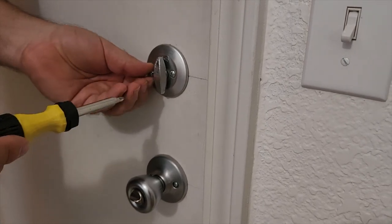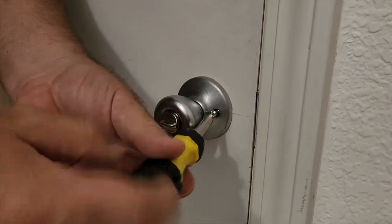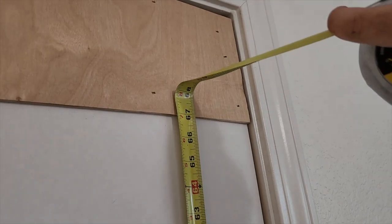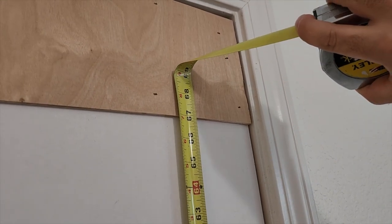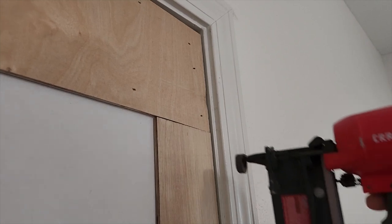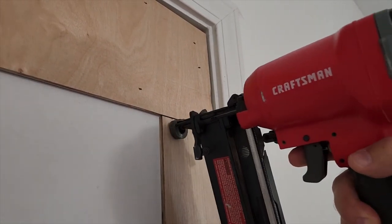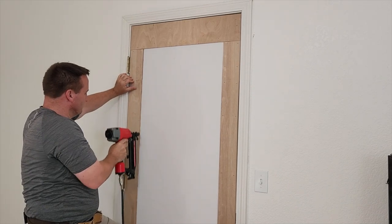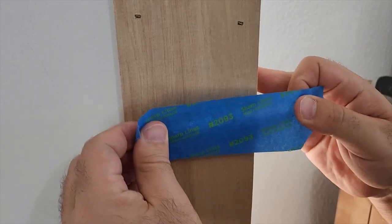Next, we've got to take the doorknobs off because we've got to put our trim around the sides. Six inches along the top was the width, but on the sides we're going to go a little bit smaller with four inch. Put the glue on the board and again nail it up and down. Not too many nails, just enough to hold it in place.